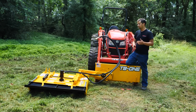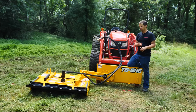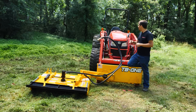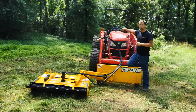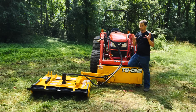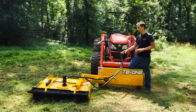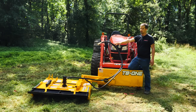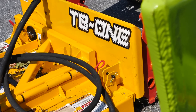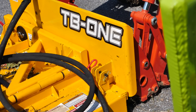You can see the very obvious pros to this — a unique mower that you can use in tricky areas where you couldn't get a lot of other mowing attachments. Obviously there are some cons too. We talked through the hydraulic plumbing being a little complex — the power pack helps with that a lot, but it is an optional piece. You can save $1,500 or more by plumbing one of these things in an alternative way, just be very cautious. There is also the safety aspect: attaching this onto the loader will allow you to put this thing into a lot of places that you should not be operating it. Spinning blades like that can throw all kinds of debris in all kinds of directions, and picking this thing up in the air and curling it back towards yourself while it's running is obviously a very bad idea — and there is nothing to prevent you from doing that.